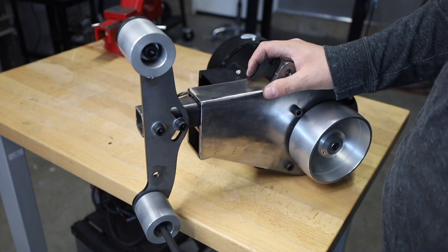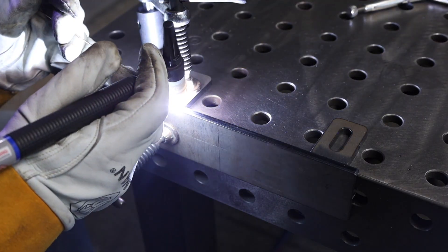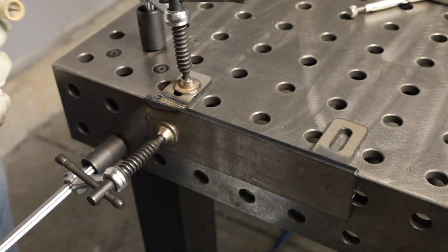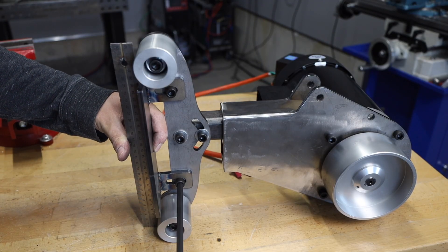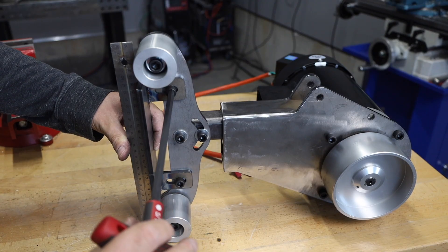This is really starting to look like a grinder now with three of the four rolls in place. While I'm working on the platen I'm going to go ahead and make a backing plate for the belt to help support it — this is simply welding two tabs to a plate that was already cut. I'll throw a fillet weld on the inside for added strength and then use a ruler to make sure it doesn't sit proud of the two rollers on the platen.